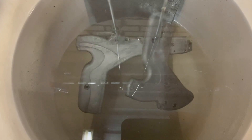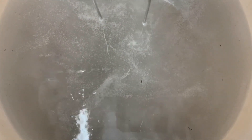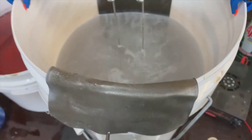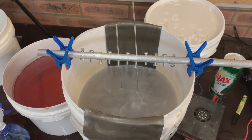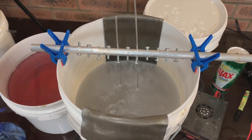They're pretty much the same thing. When it's working, it starts bubbling. Notice that my parts aren't touching each other and they're not touching the lead either. As soon as you crank on the power, you can see it happening — bubbles away. I'm using aluminium TIG rods in the solution, and they run up to this little aluminium bus bar that I made. I got the idea from another guy — I'll try and put the link in for him, give him a shout out. He's got a really good in-depth video, but this works well for me. I've got a couple of cheap pegs just to hold it in place.